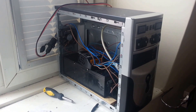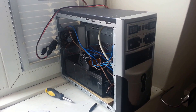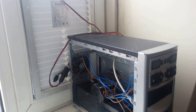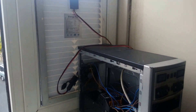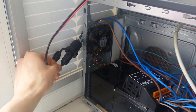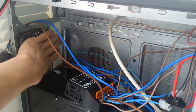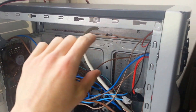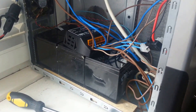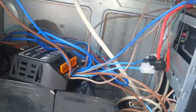Got another solar project on the go, so I thought I'd just show you all. It's not finished but I'm going to be a bit impatient and put this video up anyway. I've got my 20 watt 12 volt panel in my window, connected to my solar setup via a cigarette lighter socket. I'm going to put a shelf in the top to fit an inverter, so when it's all closed in everything's nice and neatly inside. I've got three 12 volt batteries in the bottom and my charge controller.